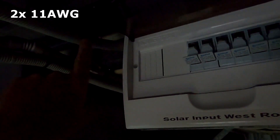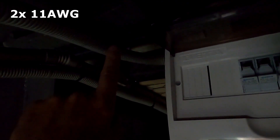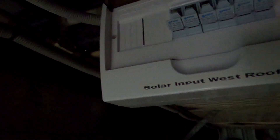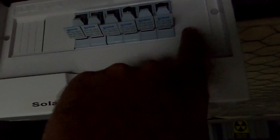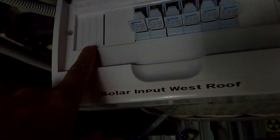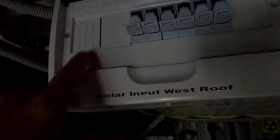We have to renew this cable here as well — it's currently a 2×4 millimeter cable and it will become a 2×16 millimeter cable, so four times as thick. Eventually this will all be populated including an SPD surge protection device, but for now this is all isolated.